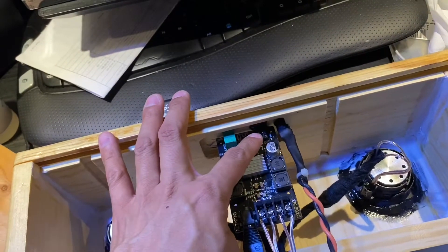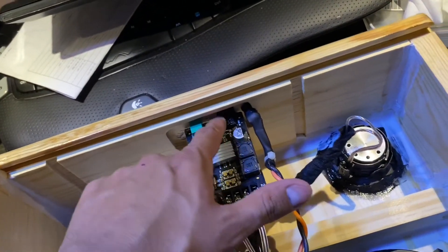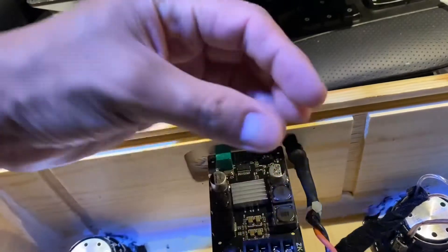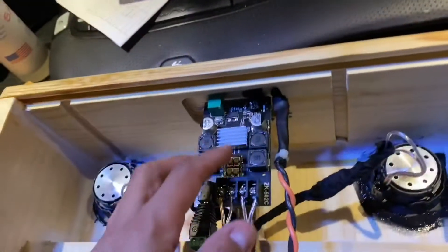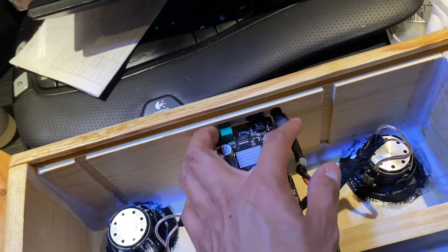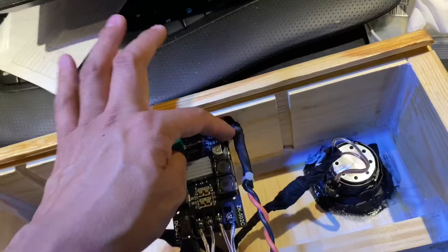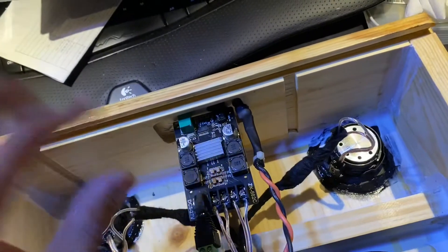If you look at these boards, they are very porous — they have a lot of holes. When you have a sealed unit like this, you're gonna hear some hissing, and you don't want that. I already put high-adhesion glue on here, then used heat shrink tubing to seal any of the holes that are naturally there, covering both the auxiliary and the power connection.